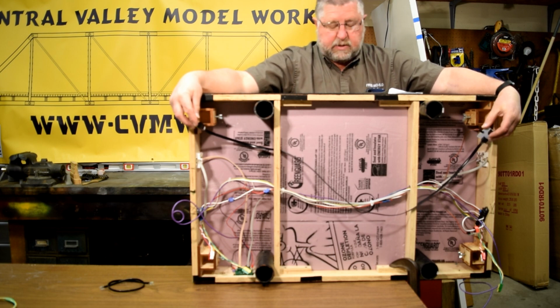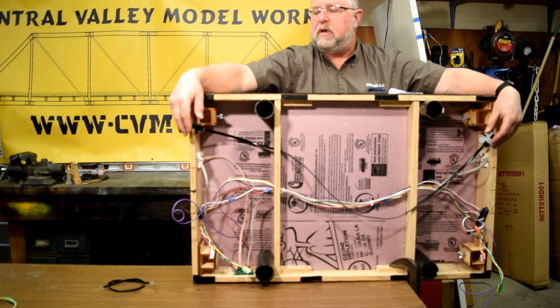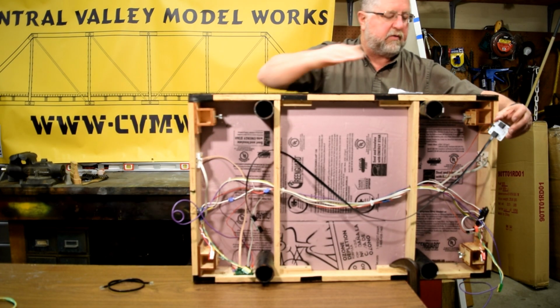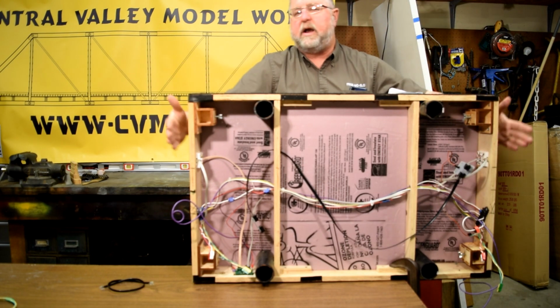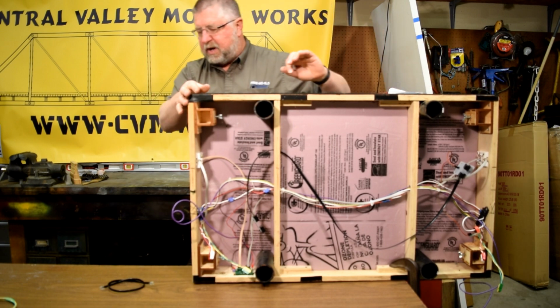Now on the MSS, what's important to remember is that modules get connected with crossover cables. So we go a crossover cable from here to the connector on the next module, a crossover cable from here to the connector on the next module on that side. So we have an odd number of crossovers inside this module, and use crossover cables connected to the next modules.